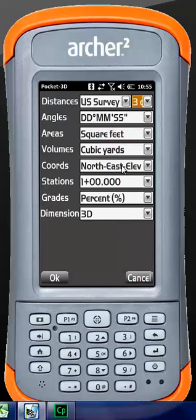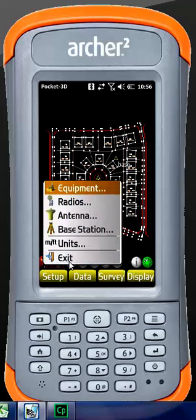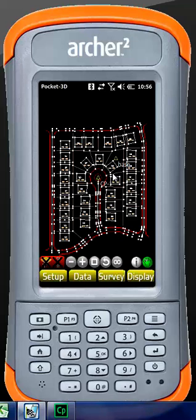Last but not least is units. When you first start, this should show two decimal places. When you see three decimal places, GPS really can't handle a thousandths of a foot — it's going to fluctuate a lot at that precision; it just doesn't have that kind of accuracy. That's why we always put it to two decimal places, because you'll notice a hundredth of a foot might fluctuate one to two hundredths, but it shouldn't move more than that. Hit OK to change it. At the end of the day, you disconnect, hit setup exit, and it saves your data.